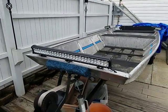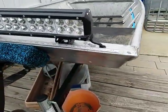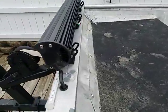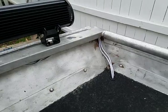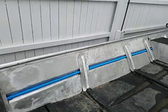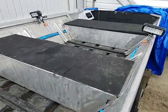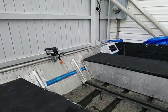I added a bar light to the front and also added some navigation lights underneath. I ran the wiring through grommets down into the bow, then ran some plastic flexible conduit tubing on both sides of my boat to make everything waterproof.